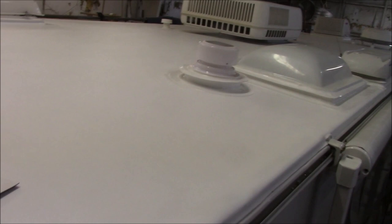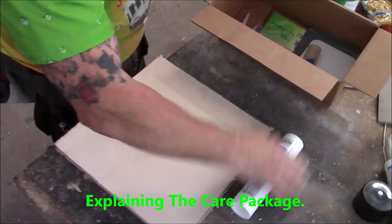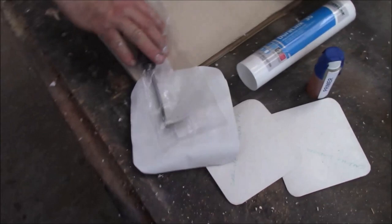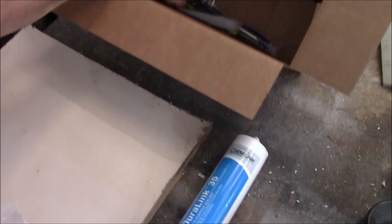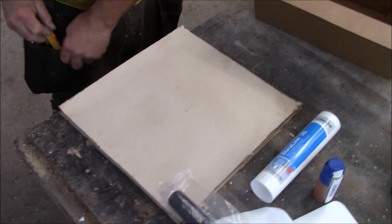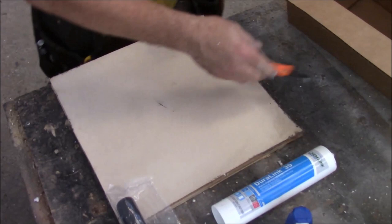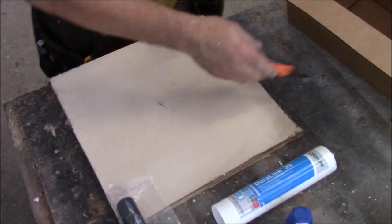What we found on this roof was pretty easy — we didn't find any damage at all, so it went along pretty well. In our care package we have: caulking, primer, two heat patches, a peel-and-stick patch, a checker tool, a magnet, pens, key chains, a brush, and a nozzle. So if we have a hole in the roof — simulate a hole, like a tree branch came through — you're like 'oh man, I've got a hole in my roof and it's raining right now.' You want to get in there and if you can't get that nozzle in, don't worry about it — make the opening a little bigger. You need to get up underneath the roofing like this.